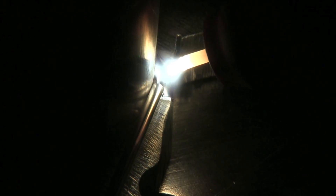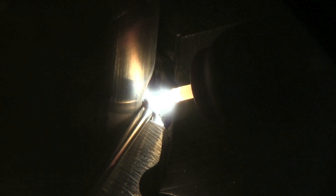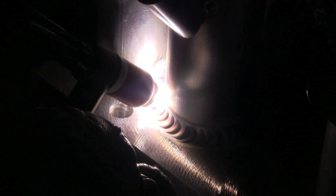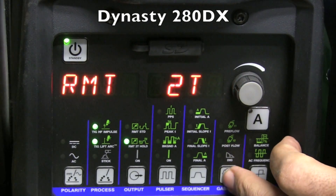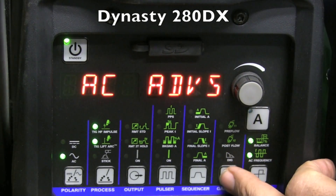This is on the actual part here — thick to thin — you kind of have to favor the thick part a little bit, but you can see it's a fairly clean puddle. The part, even though I cleaned it really well, had some previous tack welds that weren't quite ground off, so there was some stuff floating around in the puddle here and there. But relatively speaking, a very clean puddle that moved along really well. I always like to get a nice clean puddle as opposed to more penetration and pepper in the puddle.